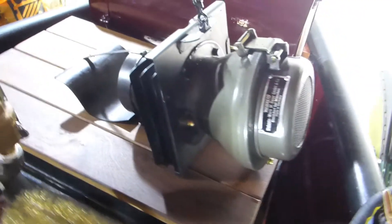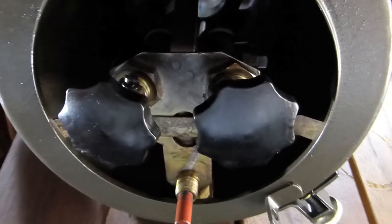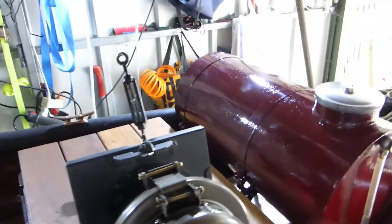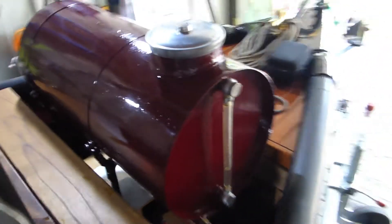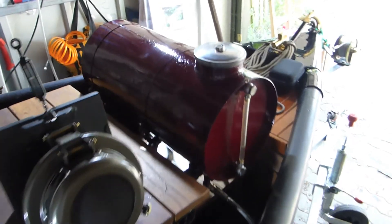The ash is taken out at the bottom. Another option for the burning process, you can use this paraffin burner, which is coming from a field kitchen — it was adapted. It has two burners inside; only one is used, the right valve here, for heating up the boiler. The whole construct is finally put into the opening of the boiler and fixed. Then you can heat it up easily to 75 psi or 100 psi. The tank for the whole supply of this burner is a 25-liter tank.